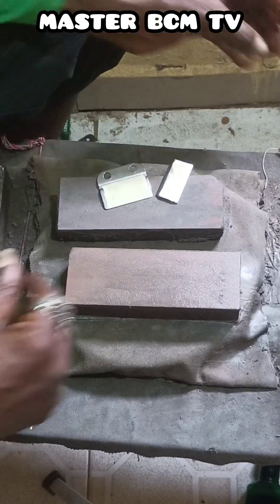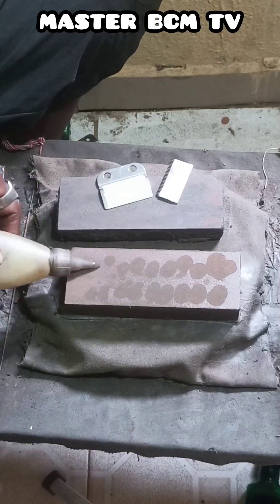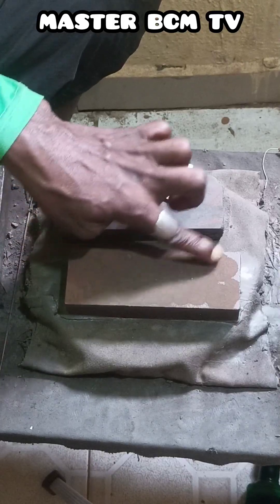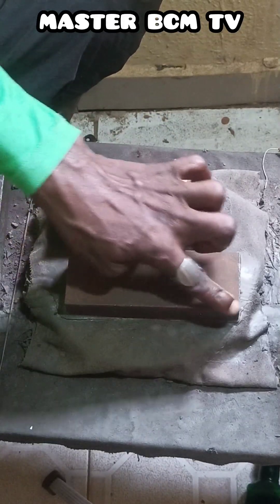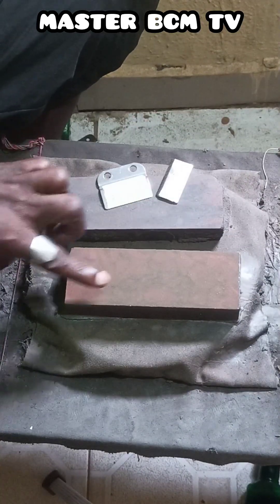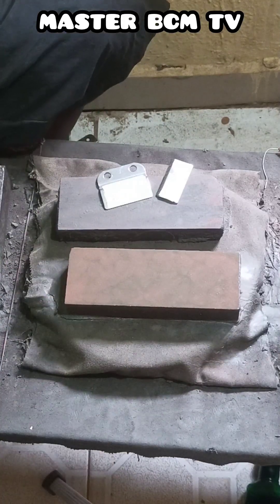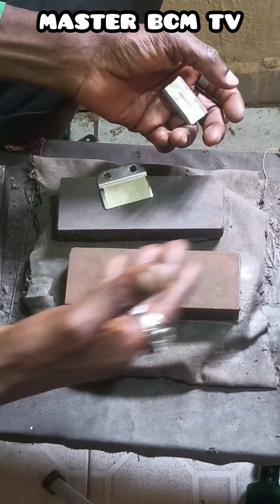After that, you take the kerosene and drop it on the surface, spreading it to cover the whole surface of the super hard manual sharpening stone. The reason for adding kerosene is that it mixes with the oil and with the particles of the special stone that were used to scrub the surface. The kerosene gives the sharpening movement free movement — more free movement when you are sharpening.